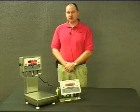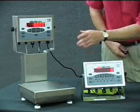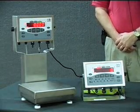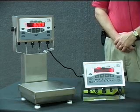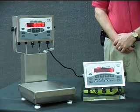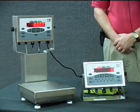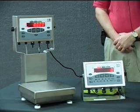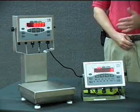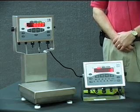The next jumper highlighted is the PC control or power control. This unit has a power button on the front, and if you press that button you can toggle the power on and off — unless you move the position of this jumper. That's important in some instances where you may not want somebody to turn the power off, keeping the unit on at all times. For instance, with the wireless option, maybe you're grabbing weight information to a PC somewhere and you don't want anybody cycling power.